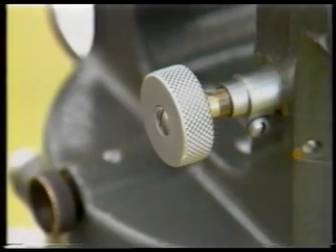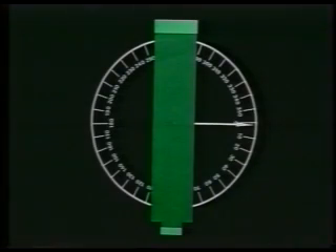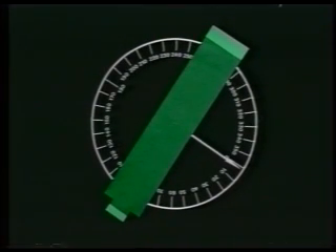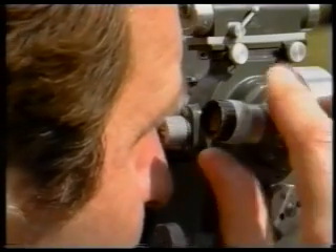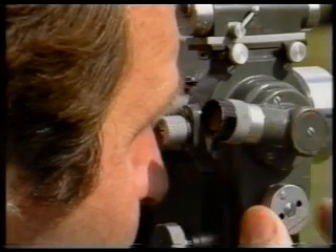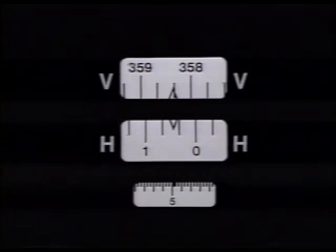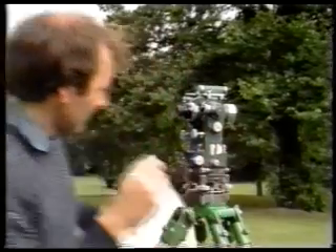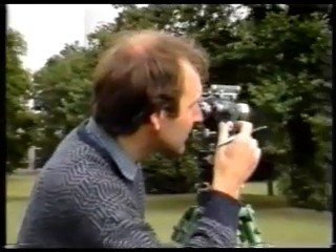The intersection was done using the vertical slow motion screw together with the lower plate slow motion screw, so the horizontal reading has not altered. Turning the lower plate slow motion screw has no effect on the horizontal circle reading. Now take the horizontal circle reading. Turn the micrometer screw on the side until you get a coincidence with one of the horizontal circle scale divisions. Here the reading is 0 degrees, 32 minutes, 40 seconds, obtained by adding the horizontal circle scale reading to the micrometer scale reading.